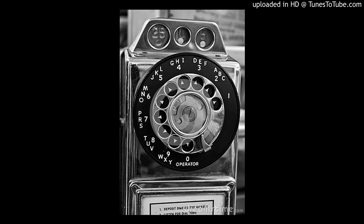In the Bell system, whenever they test for the presence of a coin, they cut the talk battery, but independent companies don't seem to share that philosophy. So you have a piece of hardware for receiving digits — in this case the NX-1's Rego — doing something that comparable hardware in Bell system offices could never do. In number 1 and number 5 crossbar, the originating registers can test for ground, but to do that they have to momentarily cut the talk battery. Thus a number 5, when it's going to test for ground before completing the call, will do this instead of just this.